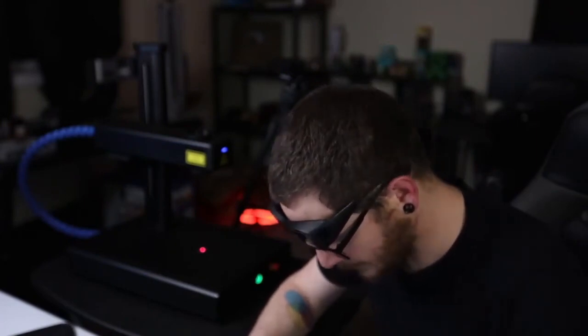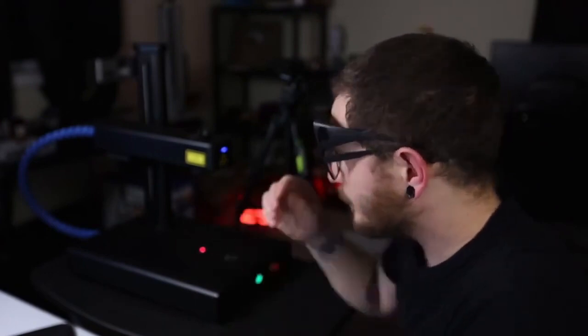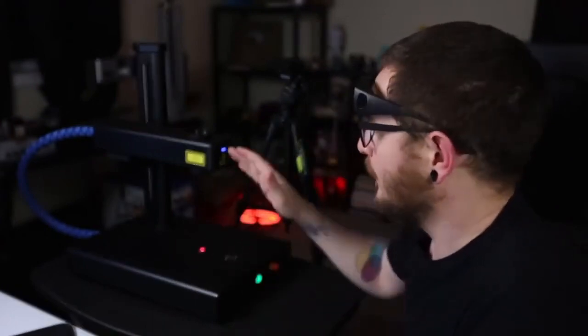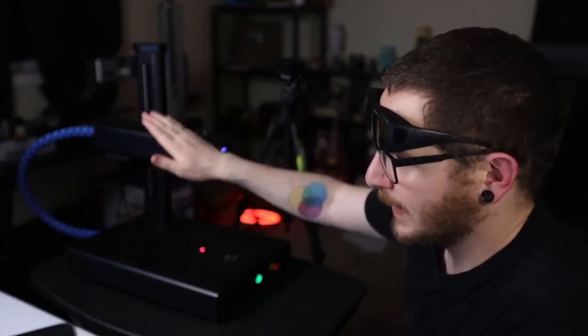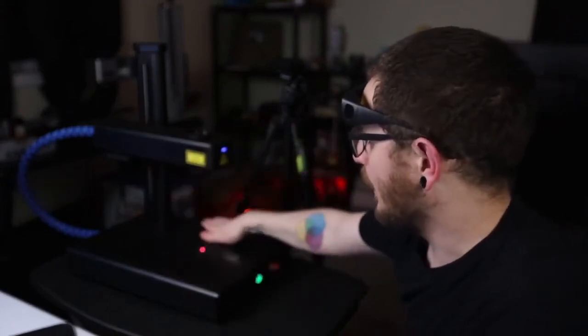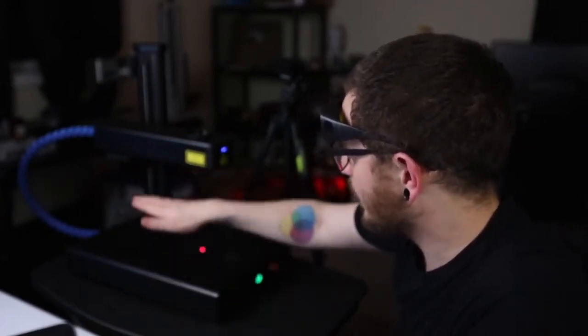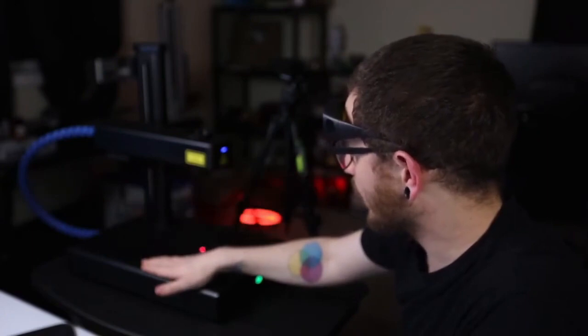And it's 10.7, it's close. So what would we be paying attention to here? What are the big things that you're gonna wanna pay attention to if you pick a laser like this up? Obviously, we have the leveling issue, right? It's not level with the bed right now, and it really should be. So we'd wanna come in, shim what we have to shim to get these two perfectly level with one another.